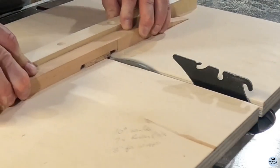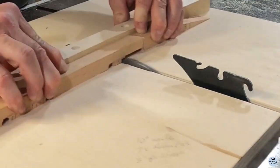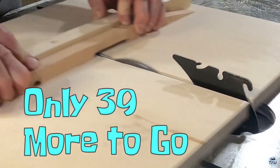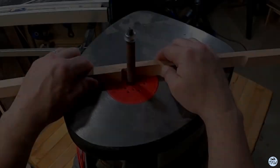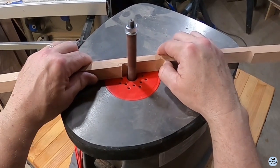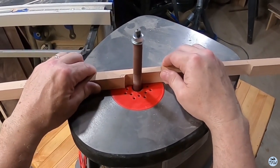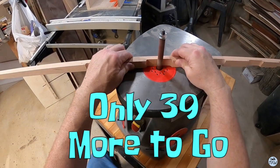But I also needed to build this particular jig to help me with the clean out. So gouging out the center between those two half moon pieces created on the drill press gives me a nice quarter inch scupper. Each of these was 3 inches long with a 4 inch gap in between each cut. 20 on each side.